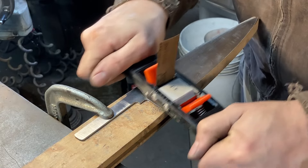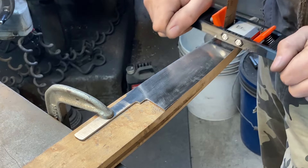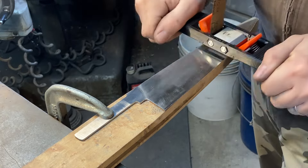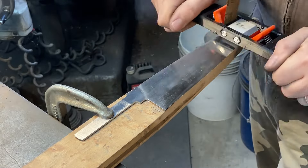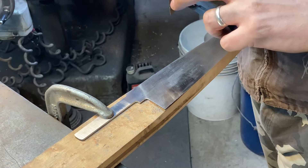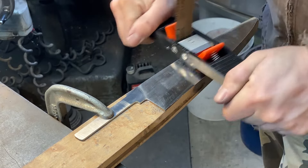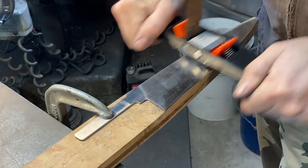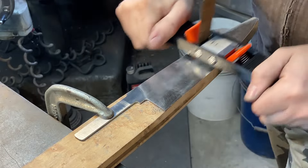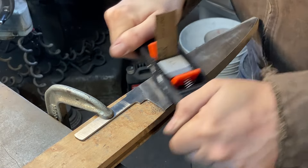However, I just get tired of having messy hands that are soaked and all gray and wrinkled, and getting water and grit contamination on the other side of my blade as I'm sanding. Particularly if I'm sanding the second side. And I'm not convinced it really prolongs the life of sandpaper that much. I can tell the difference between clogged sandpaper and worn-out sandpaper. Even sanding dry — it's not that it's getting clogged as much as if you knock the dust out, it's still dull sandpaper. I'm not going to spend a lot of my time for a small savings on sandpaper. I just throw it away when it stops cutting. I just eliminate all the mess by sanding dry, and I've been doing that for a few years and it's working fine for me.